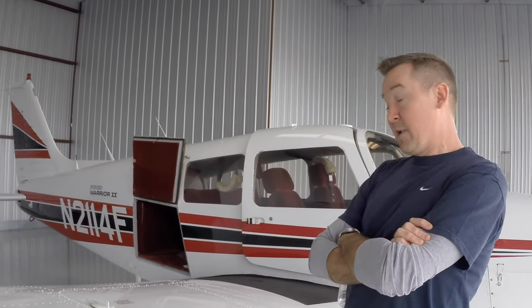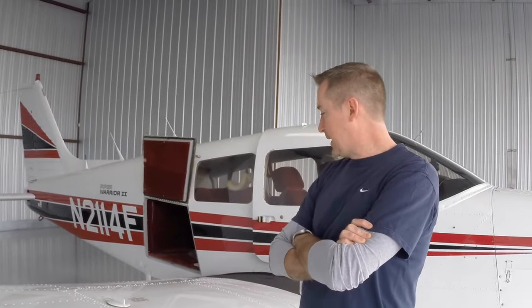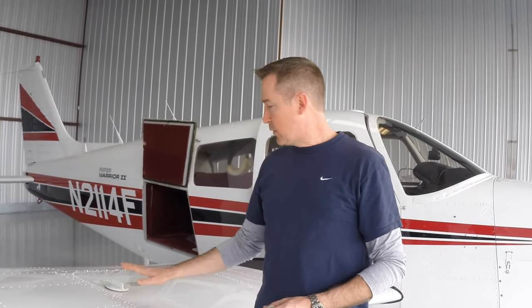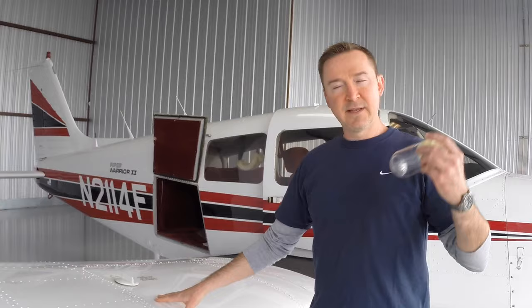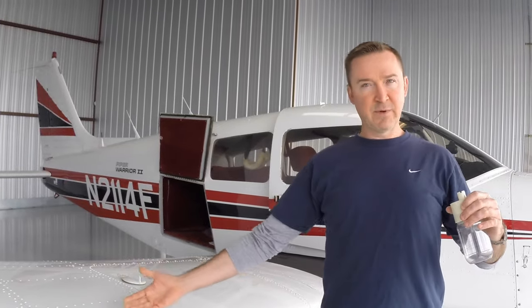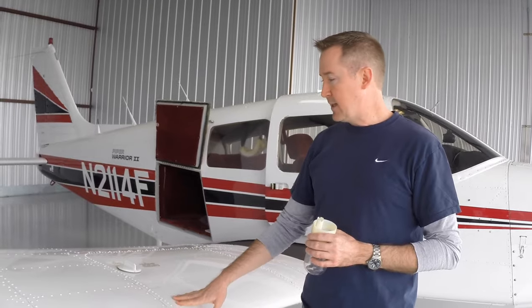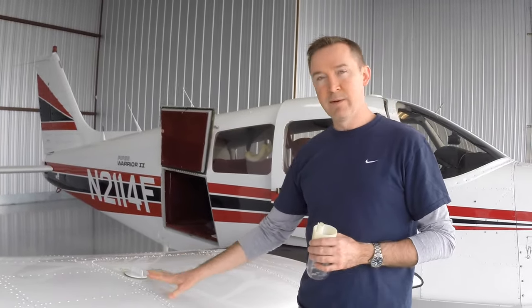That's a long time. But for our planning purposes, what we always do is plan for no more than 4 hours of flight. And the way we do that is we begin on whichever tank. Let's say we begin on the right tank. We fly that for an hour. This is the way I do it. Fly that for an hour, switch the fuel selector after an hour over to the other side, run that for 2 hours, and the first hour brings it down so that it's even with the right tank, and then another hour, that's your second hour on there, and then at that point, we switch the tanks for the second time back to the right side. We've already run it for 1 hour first. That gives us one more hour on this tank. That's 4 hours total. We don't fly more than that.